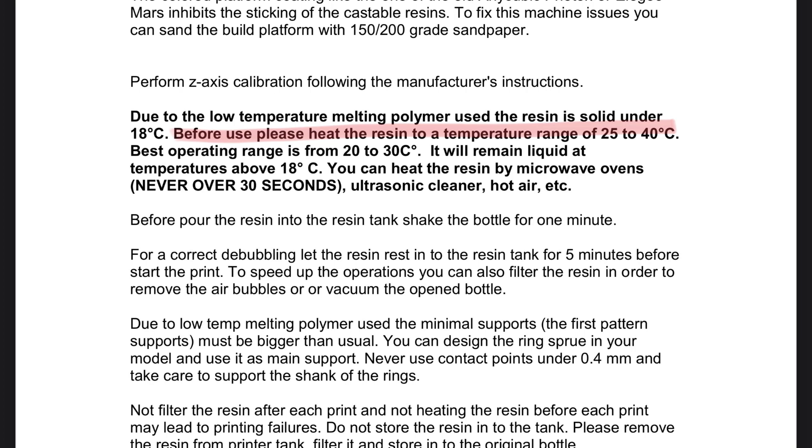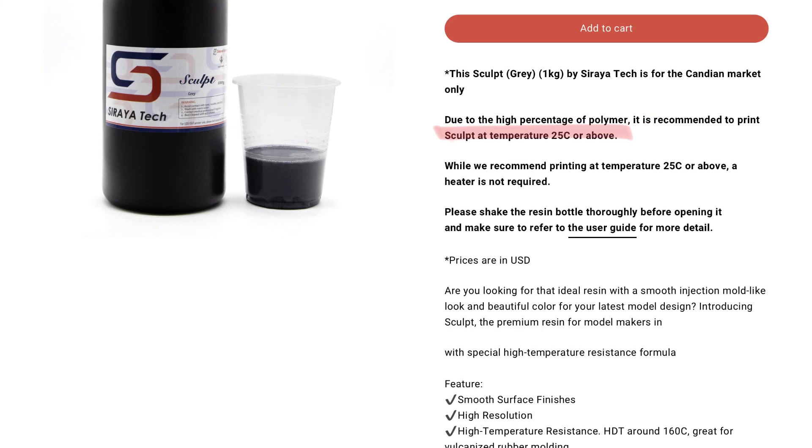If you decide to put this setup in your garage, depending on where you live, you may want to do away entirely with the ventilation in favor of just wearing a mask when immediately working with resins, and instead use a heater inside the enclosure if necessary. This will keep the resins and the machines printing well regardless of outside temperature. Some resins are easily affected by the temperature they're printed at — in particular casting resins — but many high-polymer plastic resins need to be at around 25 degrees Celsius to perform at their best. This entire setup is very versatile, with many ways to ventilate or filter the air using a basic set of extra equipment.